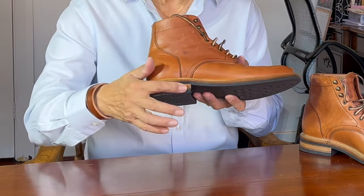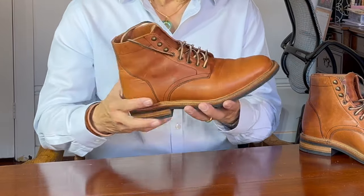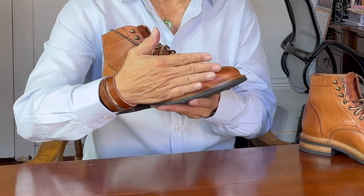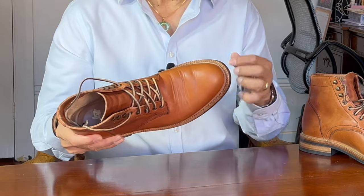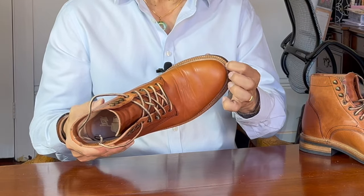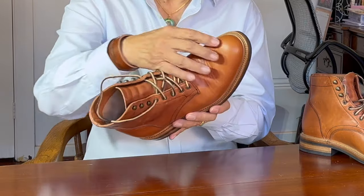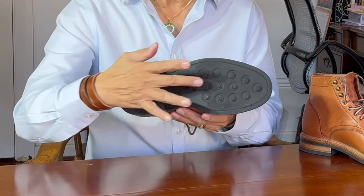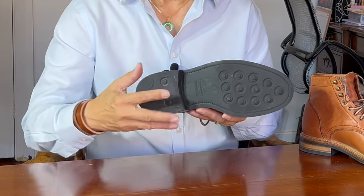The heel is stacked leather glued and nailed on, then topped with a rubber top lift. The welt is a split reverse welt, where the welt is split halfway through and then pushed up against the uppers for more water protection. The welt is also wheeled, meaning a hot grooved wheel is passed over it to create ridges along the length of the welt. When the welt is attached to the insole underneath it creates a cavity, which is filled with cork, and a steel shank is inserted in the cork spanning the heel and the ball of the foot, providing extra arch support and stability.